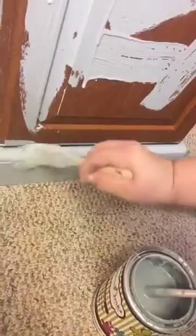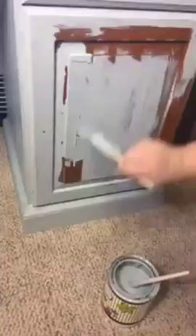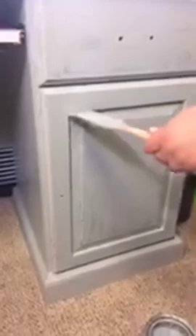See how if I've got the paint loaded on the brush, I can just spread it around without dipping a million times. A lot of times if it looks like there are some areas where the paint is repelling, that can mean you didn't prep well enough or didn't let it sit long enough — go back and prep again. I'm going to do the top next and then turn the fan on, because having a fan on makes a huge difference for dry time.